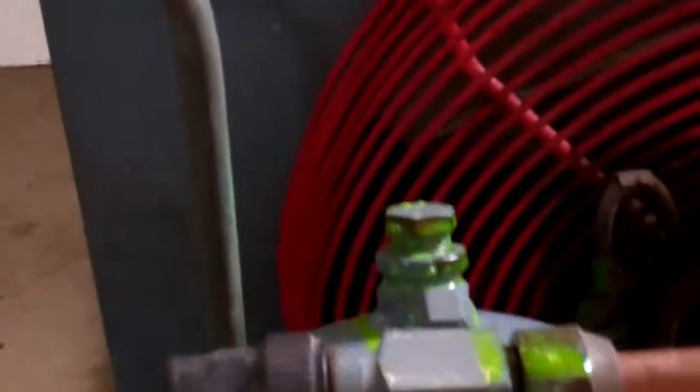I think we need a new receiver. RSV8 - so it might be eight litres. The system runs about four kilos, so as long as it's big enough to hold four kilos and a bit of spare volume. Some receivers have a total volume of say ten litres and a usable volume of eight, because you want a bit of room for expansion. You have to be careful with the ratings on these that you're matching like for like - some are sized as the total volume and some as the usable volume. If you're trying to get a replacement you can end up with one that's too small, or too big - though too big is probably not so much of a problem.